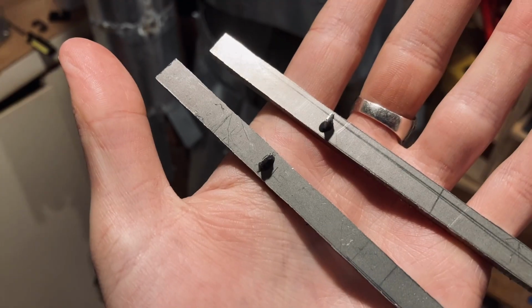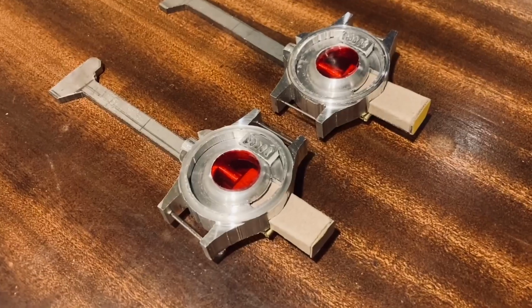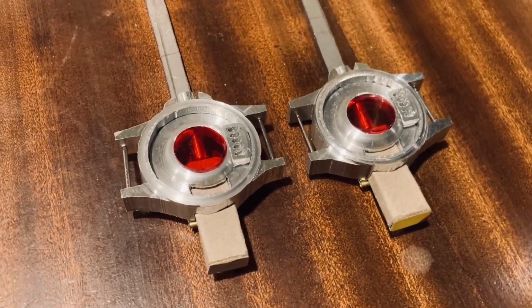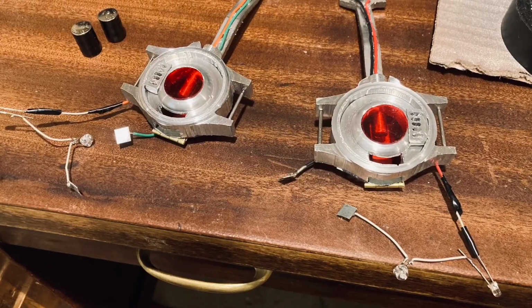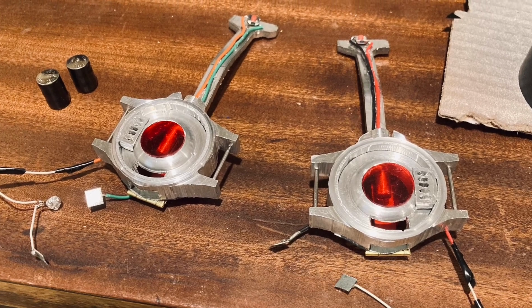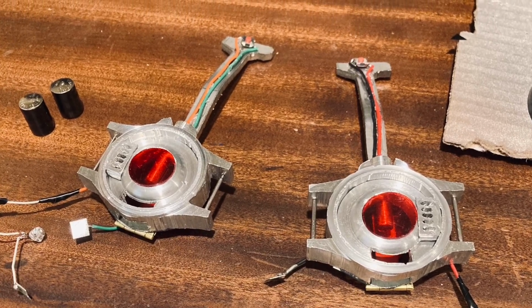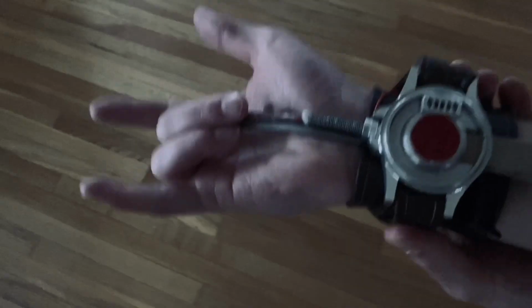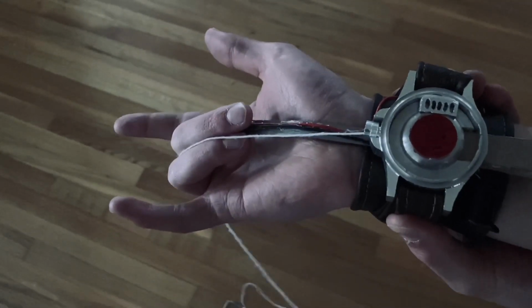So I scrapped the flexible ribbon cable idea and cut new rigid triggers out of steel. I used JB Weld to attach a stop block and hinge to the trigger, and then milled tiny slots into the launch barrel that the stop block would slide into. I removed the electromagnet from the circuit and attached the tactile switches for the LEDs to the ends of the triggers. When you press down on the tactile switch, it turns on the LEDs in the casing and pulls the stop block out of the launch barrel, releasing the spring, launch dart, and webs. You know, sometimes I amaze even myself.